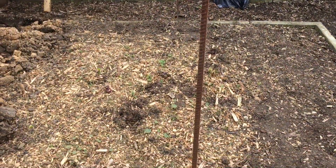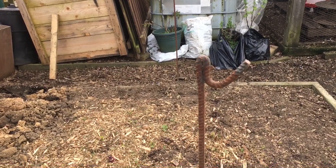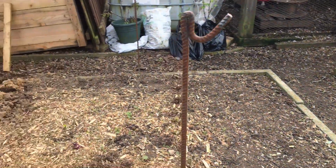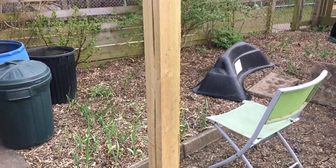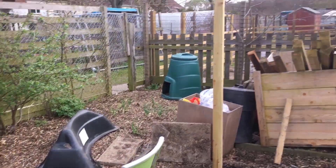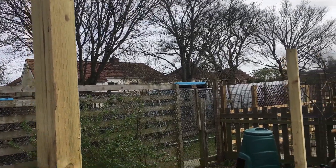From that post to that post it is 88.25 inches — I'll have to double check. I'm making sure I've put these posts in first so I've got a guide from there to there. This post is 2.7 metres; I've put about 0.7 in, so it's 2 metres above ground. It's going to have a shed roof like that — not 45 degrees, about 30 degrees anyway.